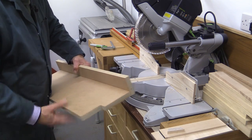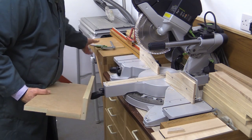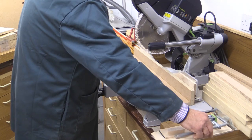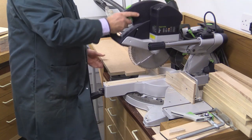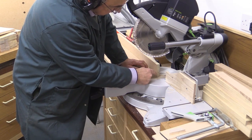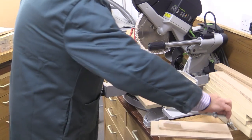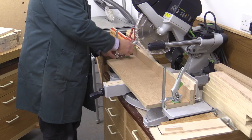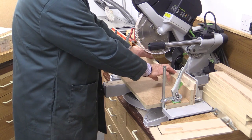You can see this now. I've got a base here. The base is long enough — the whole thing is long enough so it goes at least to where these places are here and here on the wings where you can use these clamps. Now, the trick is to use the little trenching control here so that when you trench down, you're only going just deep enough to get the saw blade into this corner here. So let's put this into position. I've opened up my fences and they're out of the way. The idea is that you put a clamp in at each end and one there. And now this protects my zero clearance fences that I made earlier.